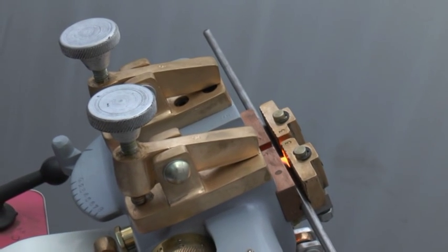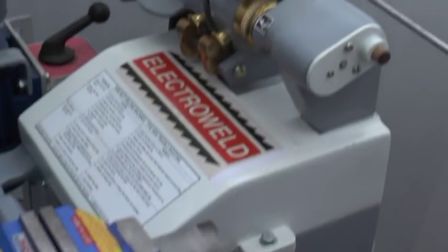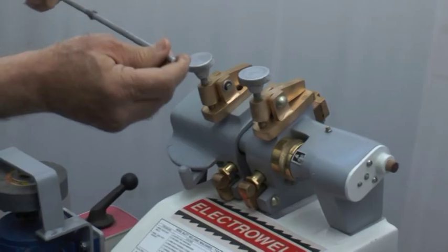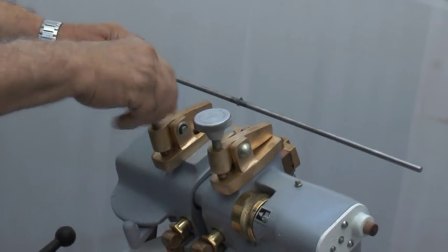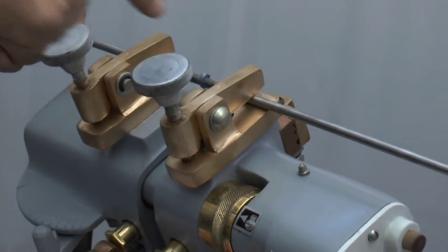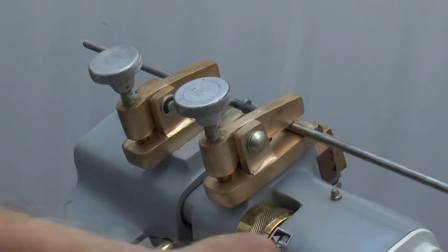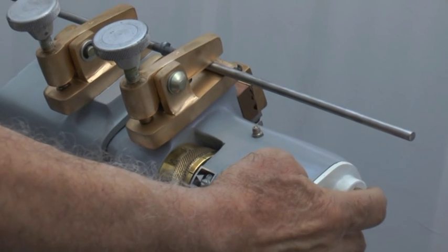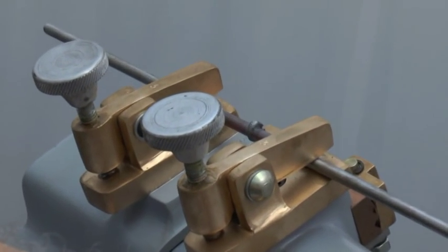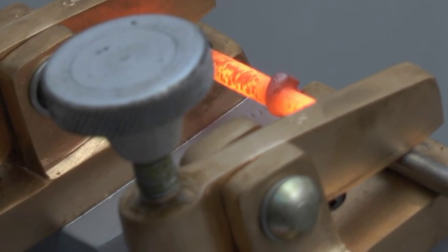See, now the wire is welded. You can declamp the wire by pressing both the pedals like this and taking this lever back to number 5. For annealing, you can clamp the wires between the two annealing jaws like this, so that the welded portion is in the center of the two annealing jaws. Clamp the welded joint firmly and then depress this same push button 2-3 times till the welded joint becomes reddish, like this. Now the wire is annealed.